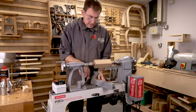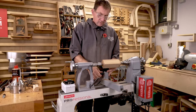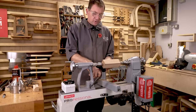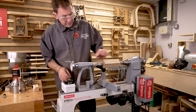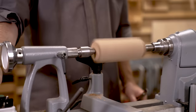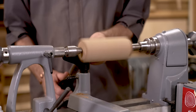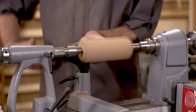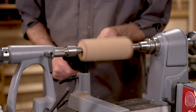So let's get to there, bring this on. A little bit short, we've got a 6-inch tool rest, a bit of wood's just a bit longer. So I've deliberately given myself a runoff area this side. Let everything off, we are about 1/4 inch below centre height. And I'm sorry if some of this is really basic, but I'll take the speed up. I'm not getting any vibration. Handle is going down low, I can rest the bevel. Gently raise my arm, so this is all about handle control now. Coming up, going to work from centre outwards.